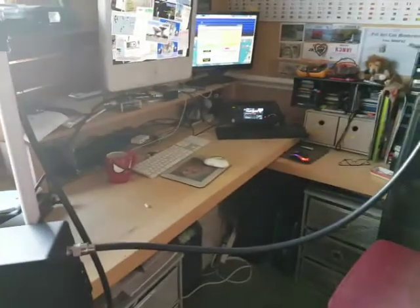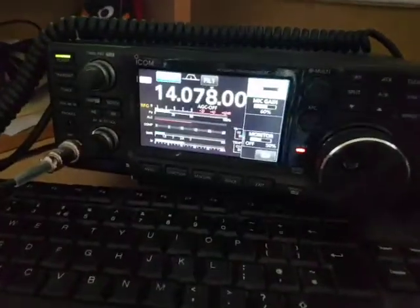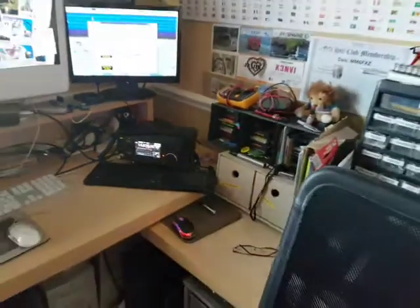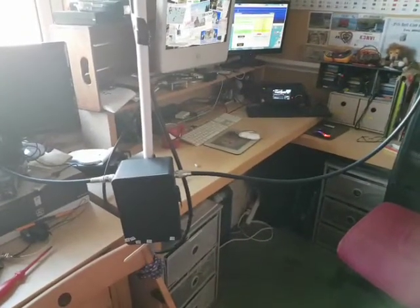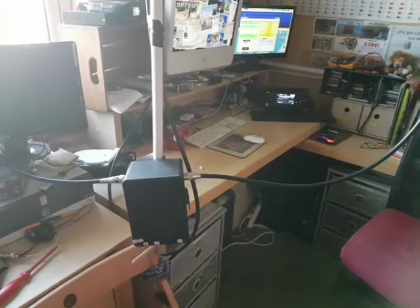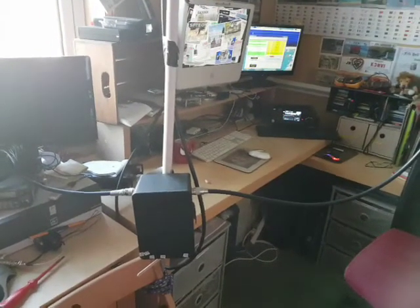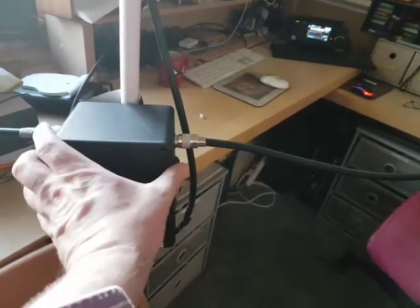As you can see — or perhaps you can see if I walk over here, although I'm very much in the way — SWR is around 1.5, sometimes I can get a bit lower. I've managed to tune this for 20 meters, 17, 15, 30, and 40, although it performs pretty poorly at 40. It does work though, and I did have a QSO. 30 is not brilliant either.